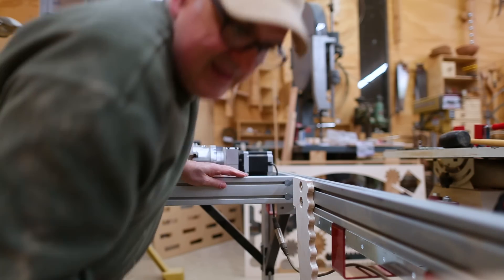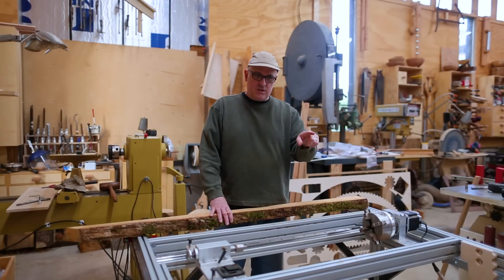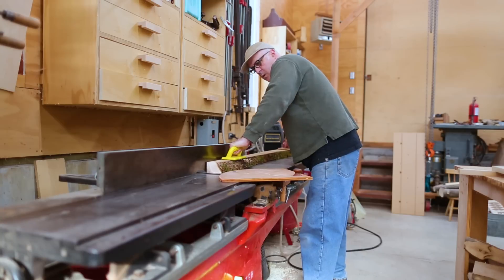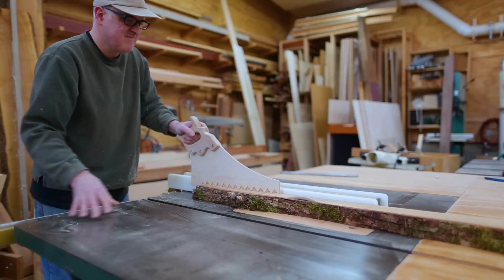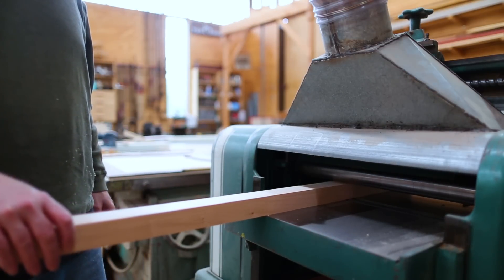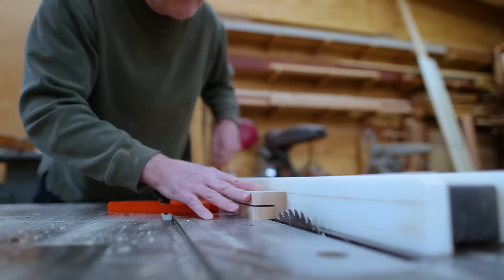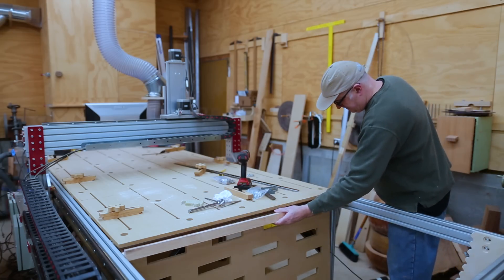I'd like to add a piece of wood along the edge of the table that the hinge for the new adjustable table can attach to — something a little denser than just going into MDF. I found a piece of maple that I cut last spring, so hopefully it's dry enough. I think I can find enough dimension in it to make the shape I want. I need to cut it to length, clean it up, get the bark off, joint and plane it. I'm going to make it so the section wraps up over the edge of the MDF and then goes underneath where I can attach it better, giving a better foundation for the hinge screws.